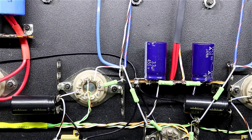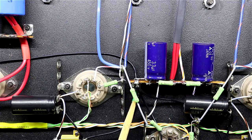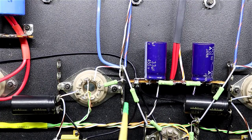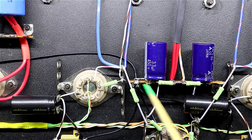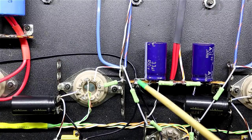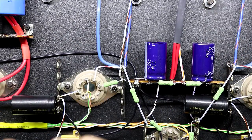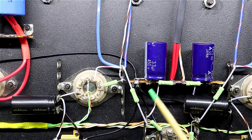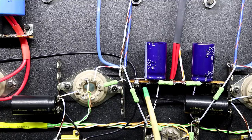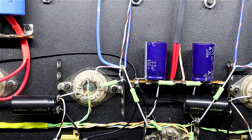One other thing, someone made a comment earlier on part 6 of this video, and they were pointing out that I had used a point here that's tied to the chassis for one of my star ground points, and was that an issue? And I replied and said, no, it's not an issue at all, as long as you take a wire from there and bring it back over to your first ground point. In other words, you don't want the ground to travel through the chassis. You want to give it the shortest possible path, which will be this wire back over there.